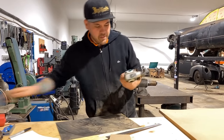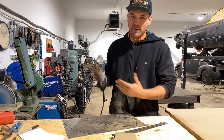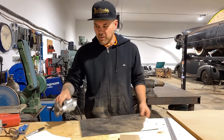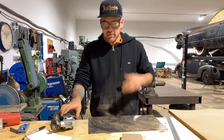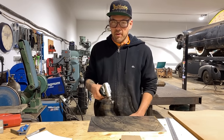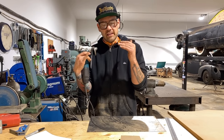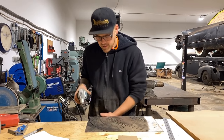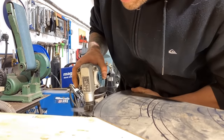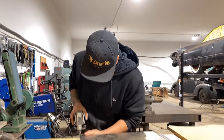If you haven't seen me use this tool before, it's a Makita power shear — I love it, not sponsored, but it's the best way to cut sheet metal like this. It cuts 16 gauge and you can do curves and all sorts of stuff. The key thing — and I see people misuse these all the time — is you don't want to go straight for your cut. You want to creep up on it because it tends to stretch the metal if held really tight on both sides. Cut close to the line and then it peels off so easily.